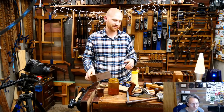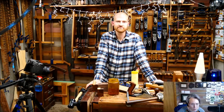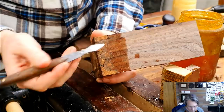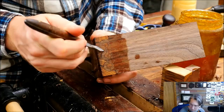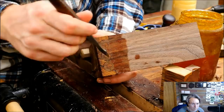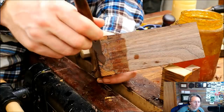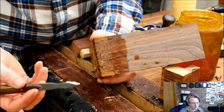And then Moonshine asks, instead of dowels, can you just carve out the posts from the tailboard? That's the one I haven't been able to find out how, because you have to get into the thin space in between. The way it would normally be done with a power tool is that this dowel here would be of the same material as this, and the router bit would just come through here and clean out all the material in each of these. Whereas with a hand tool, chiseling out the space in here is extremely difficult, because it's not a straight line. Your chisel always has to be turning around that corner. Yes, you could do it, but the time needed would be incredible. You'd probably end up taking 3 to 4 hours to make each one of these joints. So that's why I didn't do it that way.